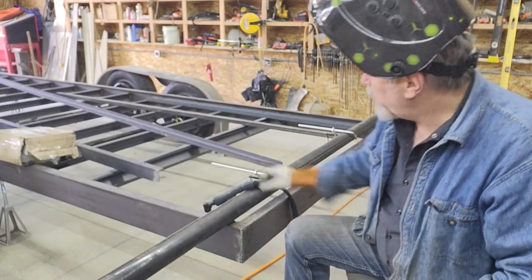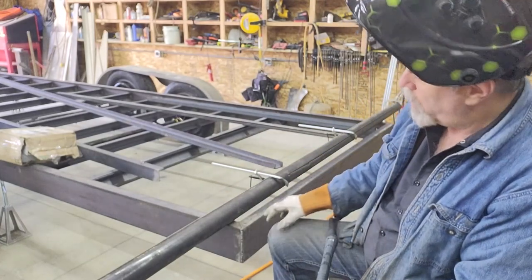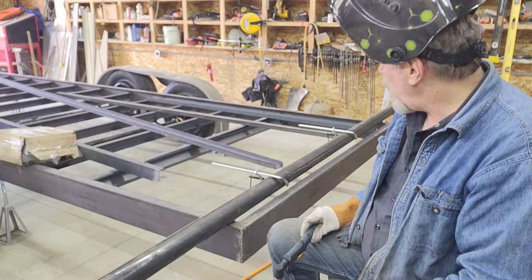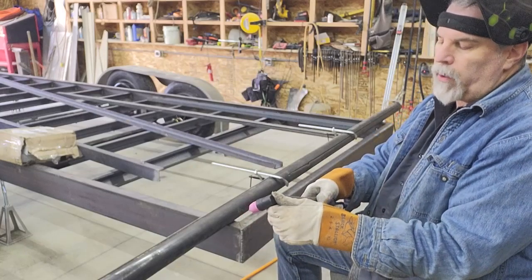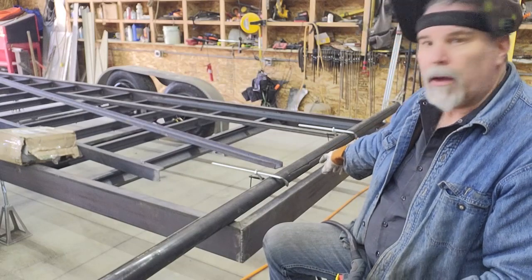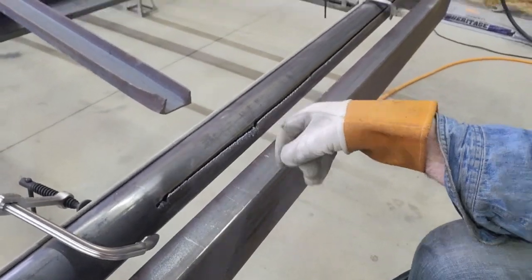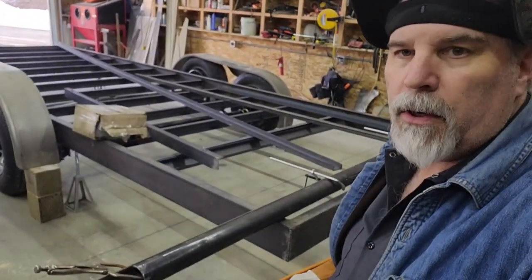Okay, I got the pipe rotated 90 degrees plus a little bit to account for the curve, and I also tipped it up. It worked out well — when the pipe is balanced on its own radius as well as the angle iron as the guide, if I hold the torch exactly perpendicular or plumb, that gives me about the perfect angle. When I did the first one, I noticed near the beginning I was actually rolling the torch up a little bit as I was swinging along, which cut into the waste piece. You can see it was starting to cut way down in there because instead of being at maybe 45 degrees to perpendicular, it was probably closer to 30.